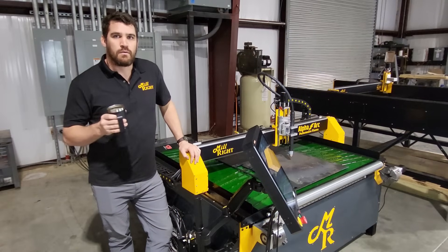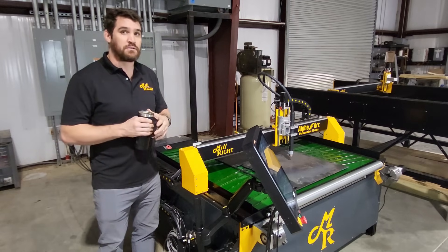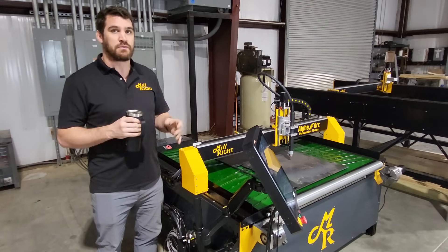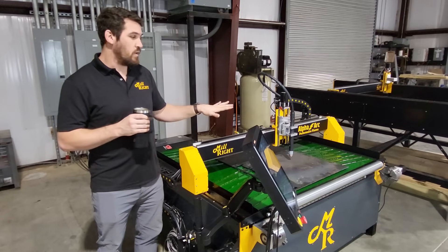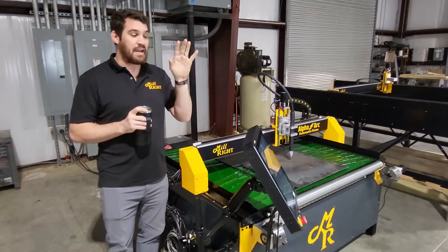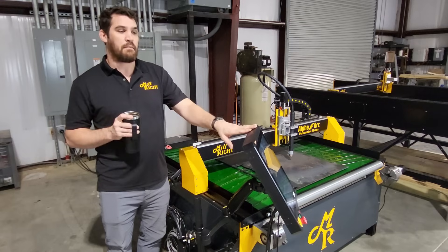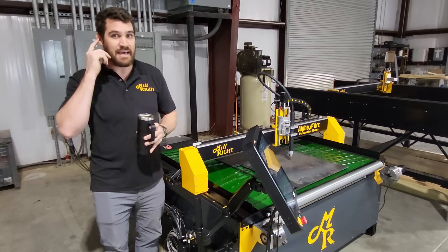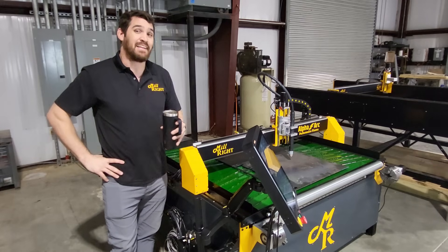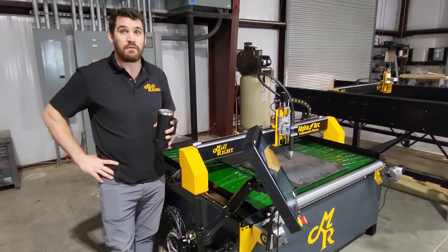There are probably more features than I can list, but starting at the frame: we've got a heavy-duty machine running linear rails and a rack and pinion system. A lot of machines out there use belts, roller wheels, or other low-end mechanisms, but we went with nice components so you have a precise machine. Beyond that, you've got an excellent control system in the Masso control. You should look up the G200 Masso G-code — it wraps a bunch of plasma functionality into one code and makes it easy to edit things. They have a good plasma interface built in, and you don't see a lot of manufacturers using the Masso for plasma machines. I think they're missing out on its capabilities.